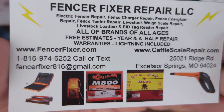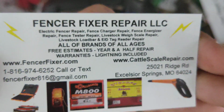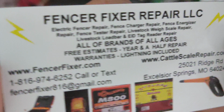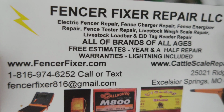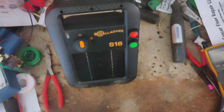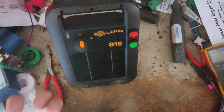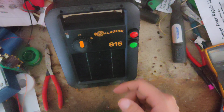But nothing really wrong with this one. It works just fine. So I don't know what the story is. I imagine the customer must have a bad short in the fence, didn't realize it, or his ground system's not quite adequate, because of the time of the year, or maybe he's just touching the fence and wasn't getting shocked by it very hard, and that could be because the grounding is too dry or not enough ground rods, or his shoes were insulating him from the ground.